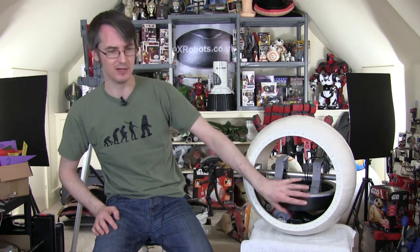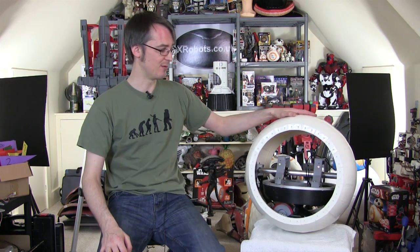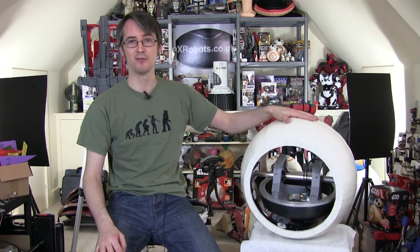I did say I was going to publish the CAD when I'd done most of the mechanics, but I'm still not totally happy that my flywheel's a bit higher than I wanted it to be. So next time I'm going to build the head mechanics and some of the actual head, and then hopefully after that I'll get a fair idea whether it will be able to stabilise itself passively. And of course with the inertial measurement unit and the PID controllers, that makes it a really easy job. So then after that I'm going to publish the CAD.